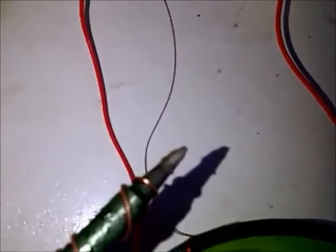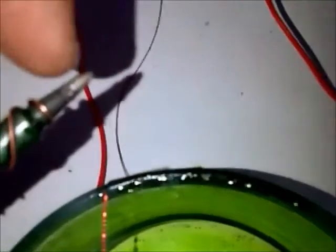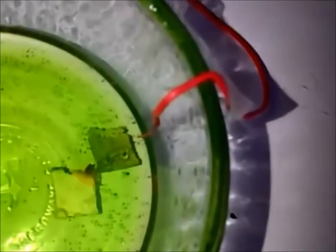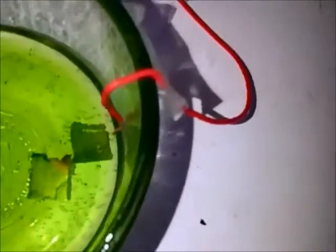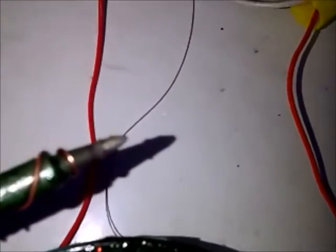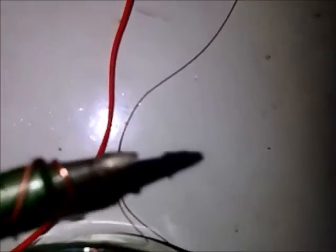It's been an hour and there is a fair amount of nickel plating on the tip now. One of the reasons I stopped the electroplating process is that the anode fell into the acid, and also there was some copper contamination within the acid, so I didn't want to continue. Now I need to clean off this tip with some distilled water, and then normal water, and we'll have a look at the plating. Looks like there's some chipping going on, but I'm hoping that's just the outer layer.